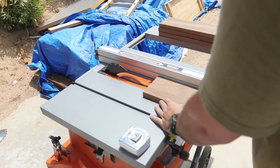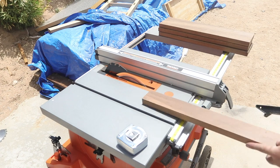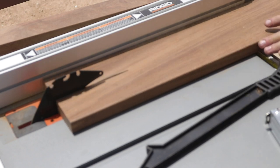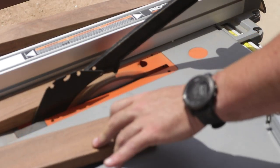Now that the chair frame is all ground down, I'm cutting up the slats for the seat. I'm going to rip them down on the table saw, get the width I want, round them over, and then sink them in. Building this project out at the Maker Ranch in Joshua Tree, Ben Ueda had some leftover tropical hardwoods from personal projects, so I decided to use those for the seat pan and the back slats.